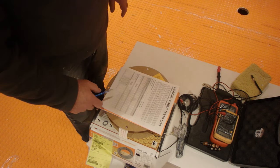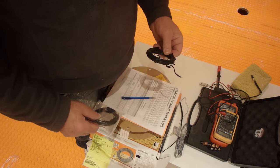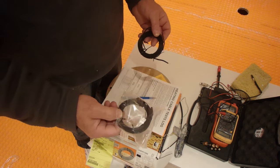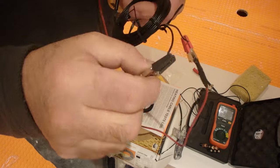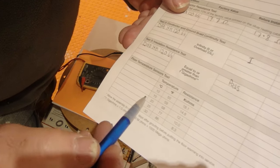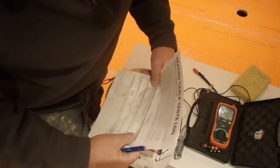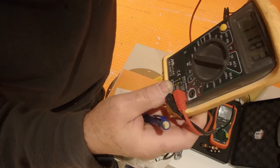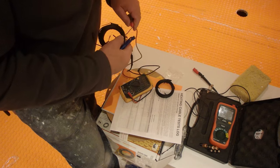These are the sensor wires — they measure temperature. If one was in your truck and one was in the house they'd have different readings. These have been sitting here for over an hour so they should be at roughly the same temperature. The temperature in here is about 70 degrees, so connect one lead to each side. Between 68 and 77 degrees the reading should be somewhere between 10 and 12. I set this to 20k and I'm reading 11.8 — that's about right.